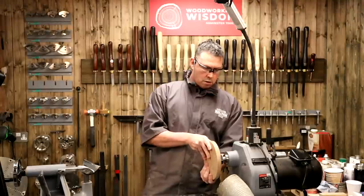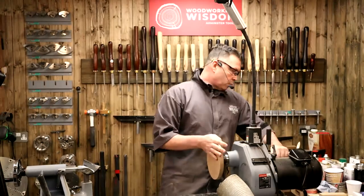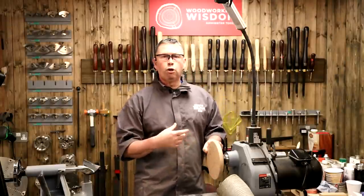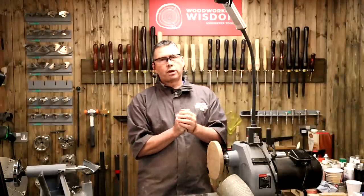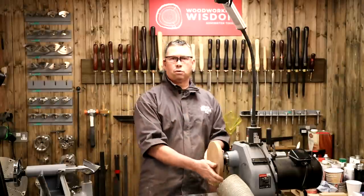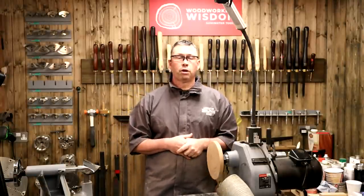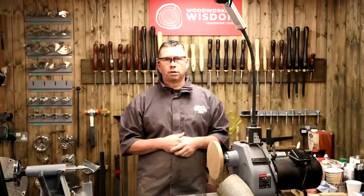So question from Martin. Would you recommend cut and polish finishes? Yeah, cut and polish, Yorkshire grit, all those sorts of things. So they've got a suspended abrasive within the wax, and that does several things. Not only does it lubricate the abrasive as you're working it, but they're great to be applied over things. So applied over a sanding sealer, applied over a lacquer, that sort of stuff. It's almost like a final polishing. So absolutely recommend those. They give you a nice gloss finish. Like I say, especially over things like lacquers are really, really good.